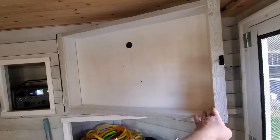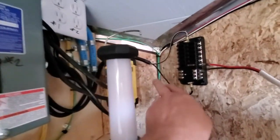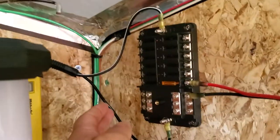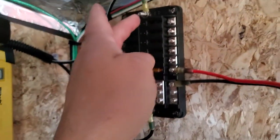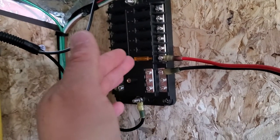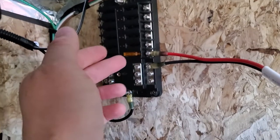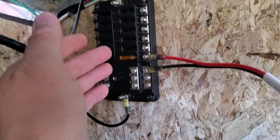This is the TV door — I took the TV out of it — and this goes through the hole and wires into my DC fuse panel. Right now you can see my positive is up here and negative is down here. I've got it just set up for testing right now, and then this flows out of my negative and positive terminals out of the fuse block.